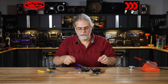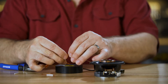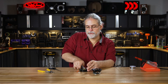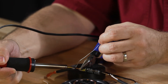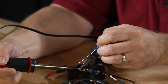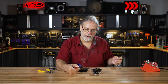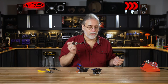We'll add our second piece of wire, reassembling it over to the other end of our capacitor. Slide your tubing on, twist the copper around the tensile lead of the capacitor, then use your needle nose as a heat sink — it also does a nice little job of clamping the wire together with the end of the terminal of the capacitor. Then we do the same thing we did on the other side by adding a bit of rosin core solder into the terminal. Just a little dab will do you — spread that through the wire slightly. And our second connection is made.